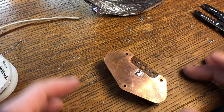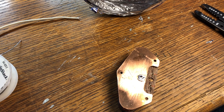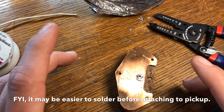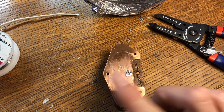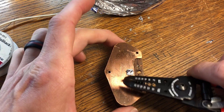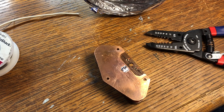By far, this is the hardest part of the whole ordeal. It's hard to get this thing hot enough to get it to stick. You basically need to run your soldering iron up as hot as you can get it. Then you're going to hold it on here for minutes and try to get this plate hot enough to get the solder to pull. Just remember: a lot of heat and you've got to hold that soldering iron on there for a while for it to actually do what you want it to do.